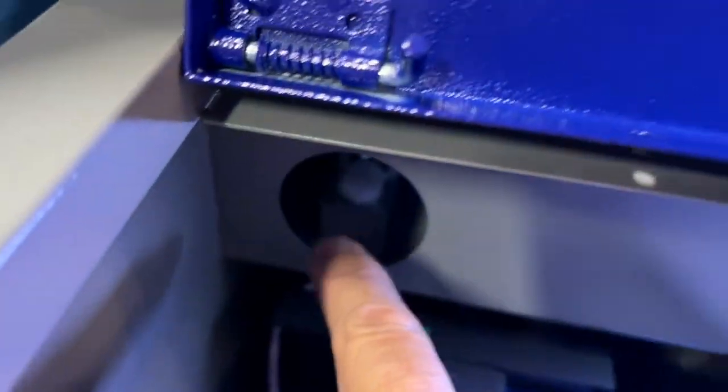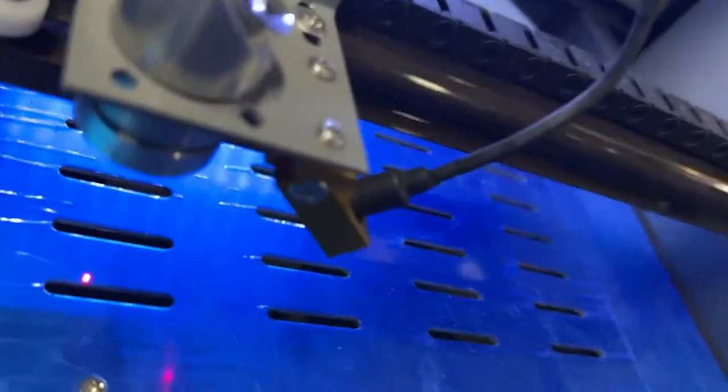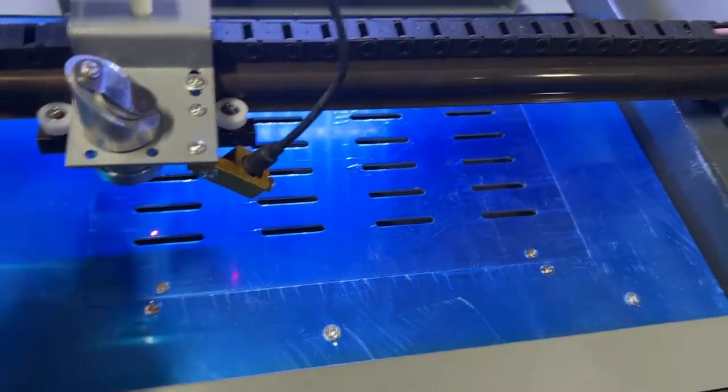I really like the way that the instructions were done. I like the fact that it's LightBurn capable — that's the go-to software for laser cutters. I really like the build quality, and the way the CO2 tube was protected in the back means you could easily move this around as long as you lock the gantry. I love the way that lasers work with those mirrors, though based on packaging, you're going to have to align the lasers — that's just part of the nature of this.